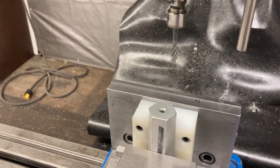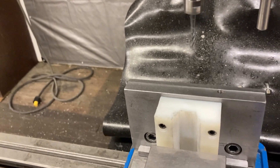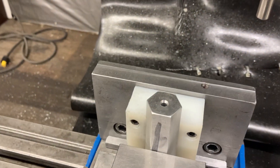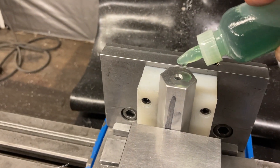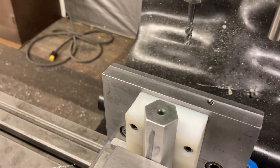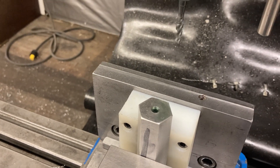Index out of the way, position out of the way — boom, rinse and repeat. Open the vise, take them out, clear the chips. Put the next piece back in — witness mark so I know I'm loading them right. Put it in, close the vise, and I'll do one more. Fill that hole up with some juice. That's excessive, I'm using more than I need, but I'm sure the tap likes it — in that oil bath going deep down into that blind hole, everything works better with lubrication.